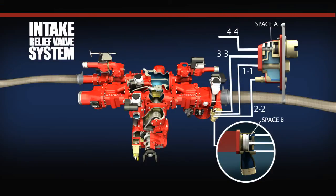Pilot Valve Assembly Operating with Main Valve Open. In this scenario, the intake water pressure has exceeded the preset value of the intake pilot valve. In this mode, the pressure in space A acting on the diaphragm will overcome the compression force on the pilot valve pressure-adjusting spring. At that point, the control piston lifts off its seat and the control valve is open.